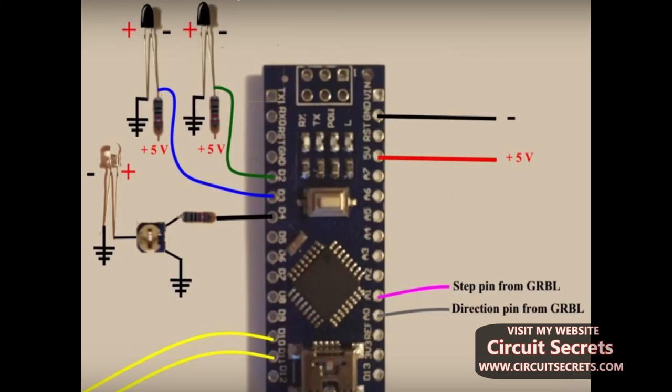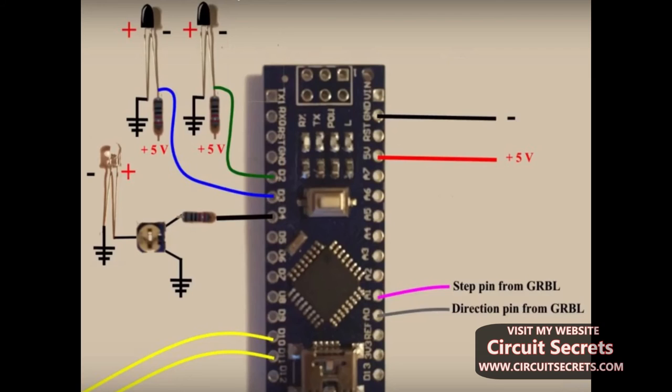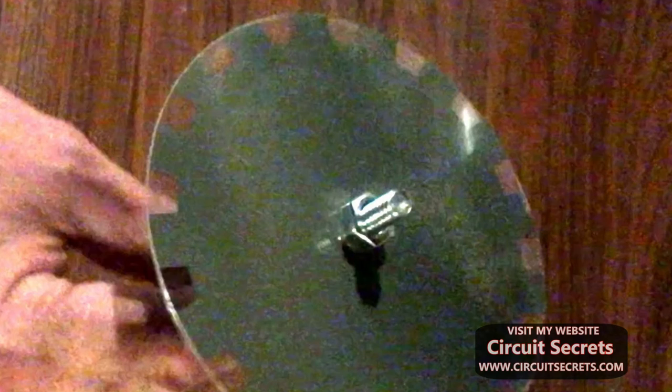When one wire is low, a PWM signal on the other wire controls the speed of the motor in one direction. When the signals are reversed — swapping the PWM signal to ground and ground to PWM — the motor turns in the opposite direction. The H-bridges have separate connections for the motor power and ground, which should be rated according to the H-bridge's capability and the motor's requirements. The other connections on the motor control boards are connected to infrared receive transistors and an infrared emitter diode, which form the optical encoder that reads the homemade encoder wheels.